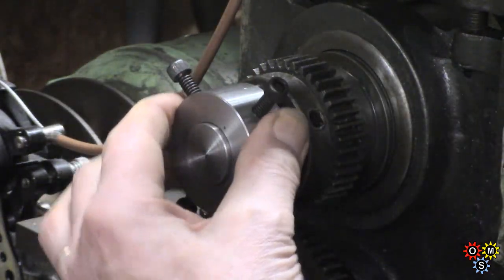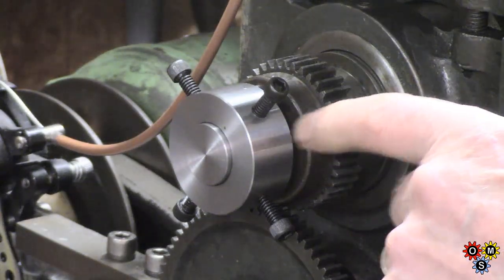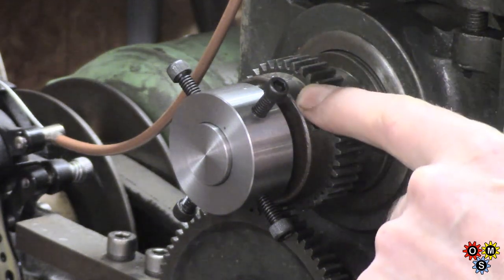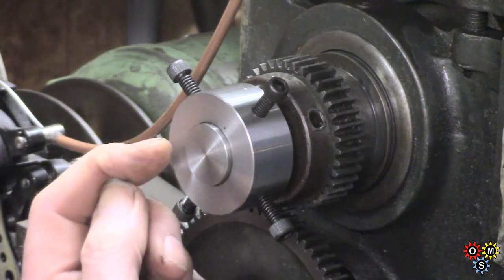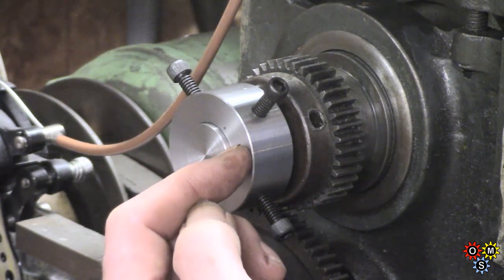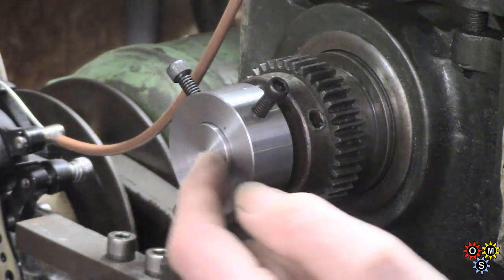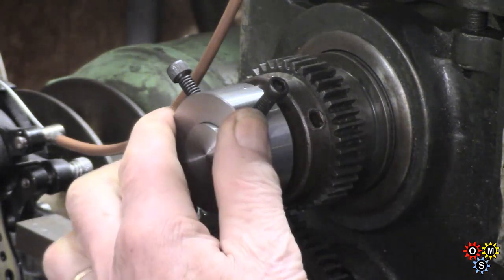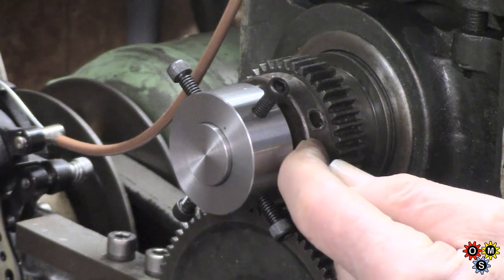Now, there's not much movement left in there, but we're actually in the spindle and not the collar. The collar's threaded on the spindle. So I think what we'll have to do is drill 2 holes here and here. Probably drill those tapping size, do that in the mill. We'll come back here and put this in position and drill through the tapping hole into the collar.